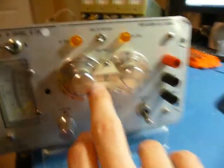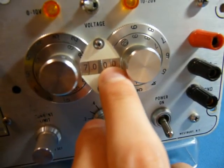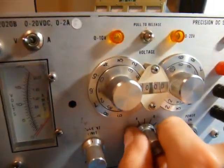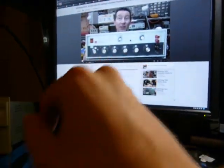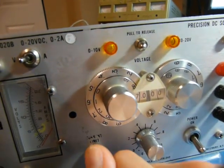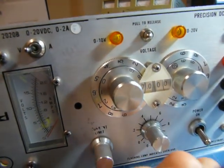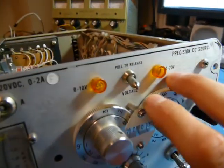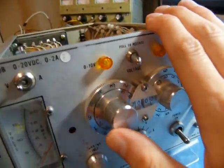As you might imagine, due to the lower number of digits in this one, this device is a lot simpler. His device has a chopper amplifier to basically remove all the DC offset, whereas this one does not — you have to actually manually zero it. And his resistors are much higher precision than this one, but the theory of operation is pretty much identical.